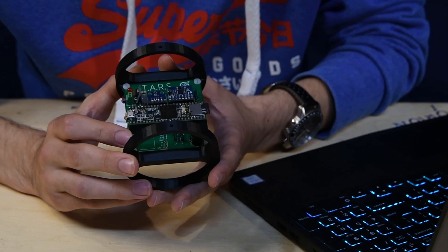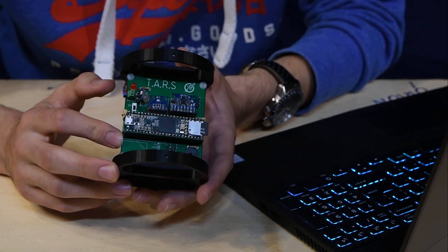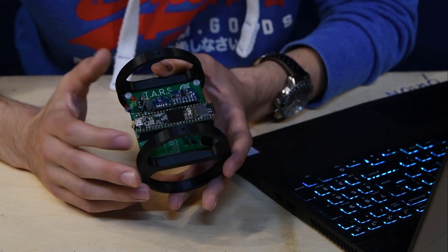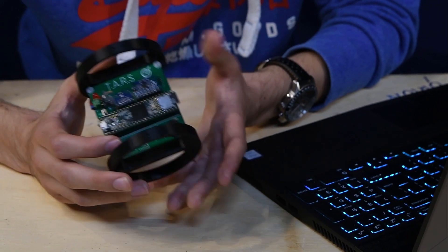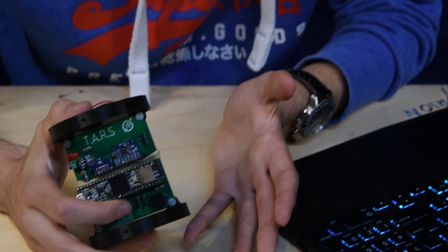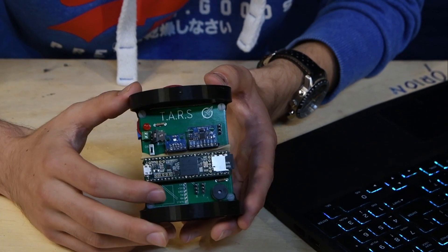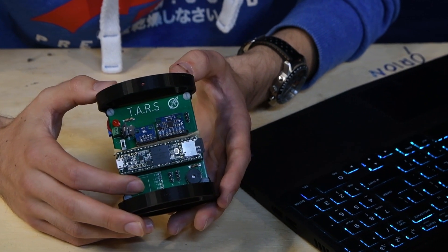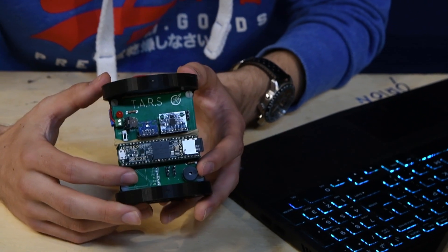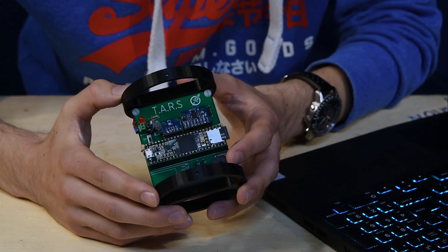You'll notice there's an empty spot on the board. This is in case we ever want to do transmission — we debated about Bluetooth communication or live telemetry downlink, but we're not sure at the moment. It's there in case we want that future applicability. Then down here we have the X and Y indications for our TVC, because the whole point of this is thrust vectoring — those are your servo points. You attach the servo to them and the servo does whatever the flight computer tells it to. We've also got a little buzzer, just to make beep boops so we can hear and make sure everything is going well. And that basically concludes our little journey.